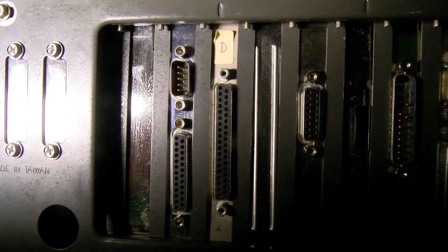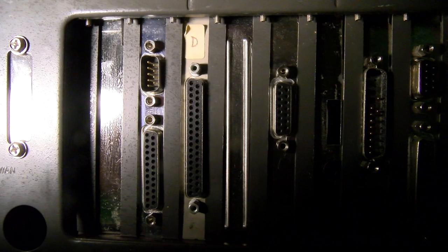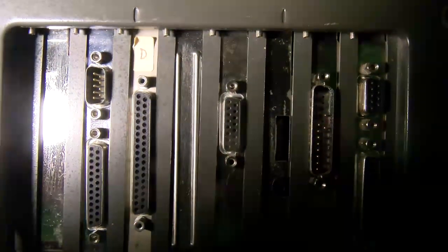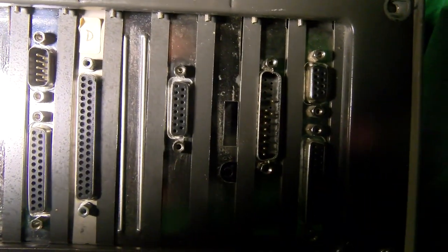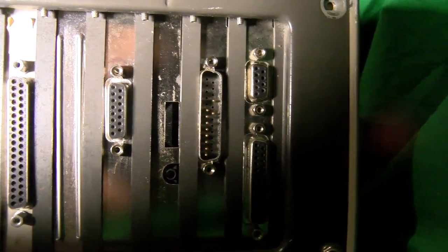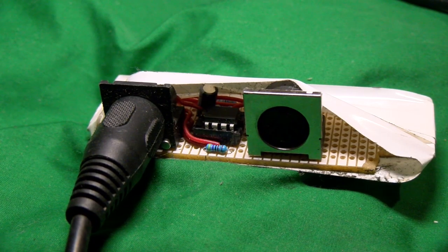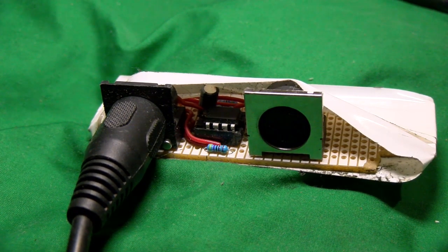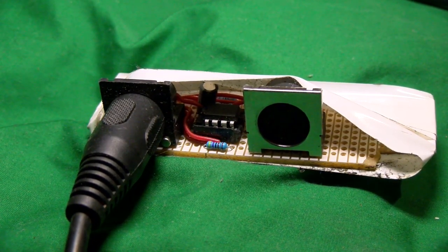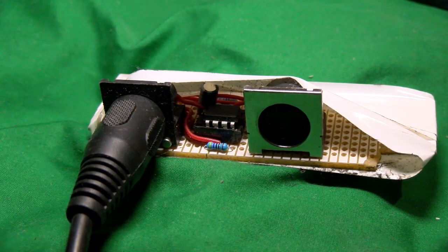You can spend lots of money on some usually terrible keyboard for an XT system, spend probably even more money on a slightly better keyboard with a mode switch that can be used on XT or AT type systems, or finally, use an adapter of some kind which might be cheaper. Because I'm cheap and most of the keyboards were bad and expensive, I employed the Key Defiddler to handle this problem and let me use just about any old AT keyboard to do the job. Yeah, those will work fine with a PS2 keyboard too, and in theory it might work with USB ones that can plug into PS2 ports.